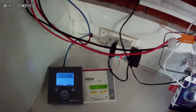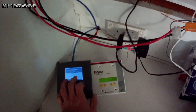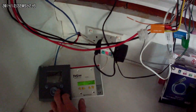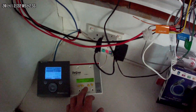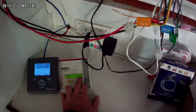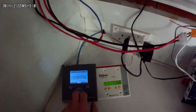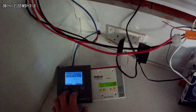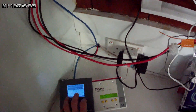Good morning. The batteries are in absorb mode at 29.7V — I had it set for 29.6, so I'll need some adjustment. I've got 6.4 amps coming in to keep the batteries happy, and I'm back at 100% state of charge already by about nine o'clock in the morning. I've got 6.6 amps coming in.